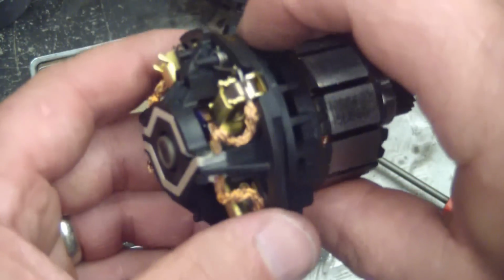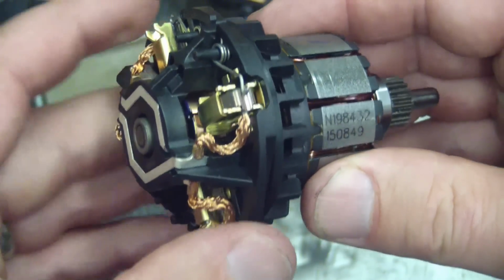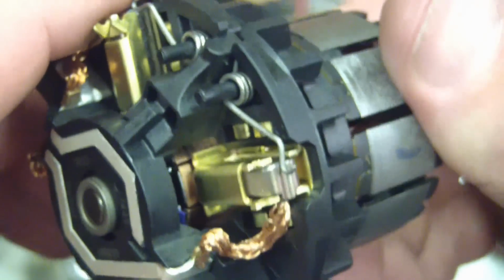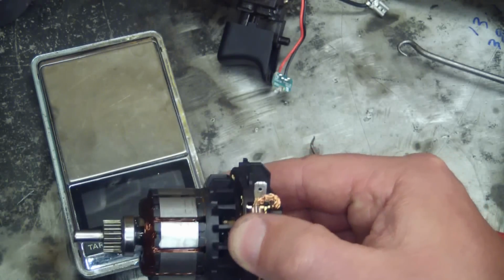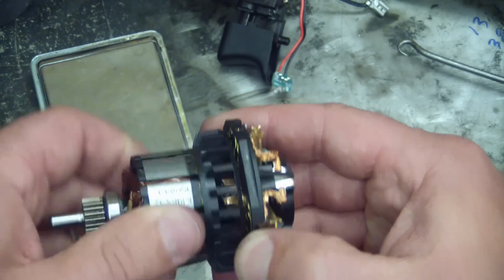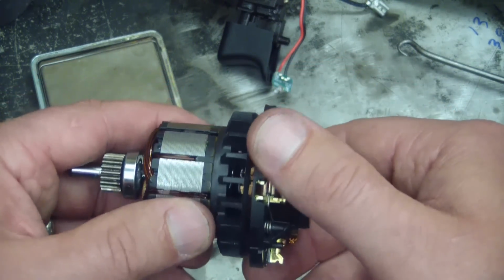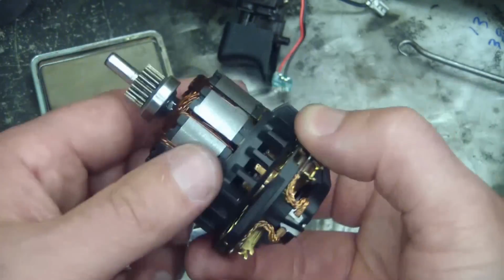Another little thing that's interesting about this, and I've seen this on high voltage slip rings before, is the commutator bars are actually grooved. Normally they'd be polished smooth there, but these ones are grooved. So does that make better contact, or does it make more arcing? Well, she ain't big, but she sure is pretty. Straight blade impeller, of course, because it's got to turn forward and reverse. And if you look down there at the windings, they also are epoxied at the bottom of the winding, and that's where they break a lot of times. So that is excellent. It belongs in a dinky car.